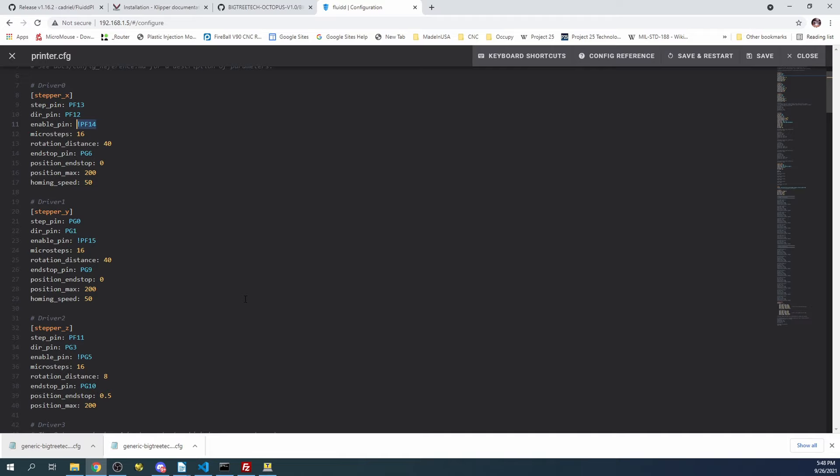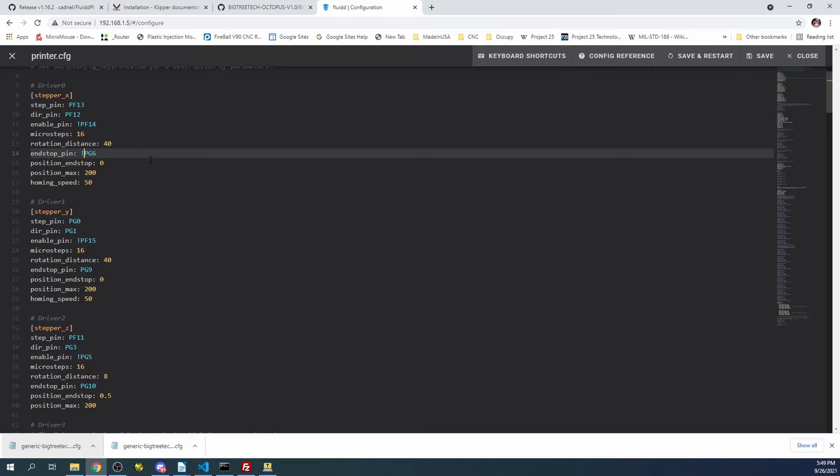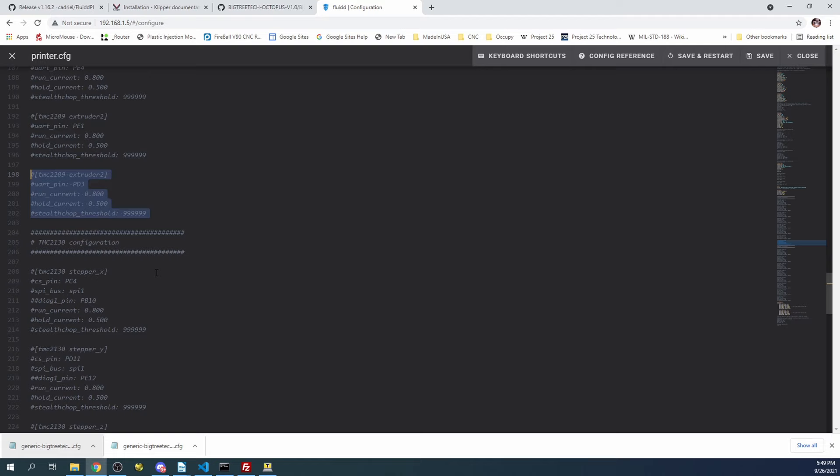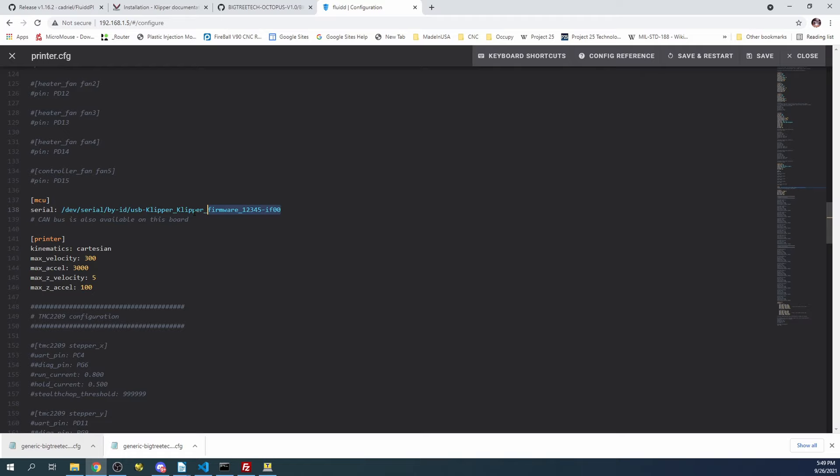In the case of our actual end stops, they're integrated into the X axis for the drivers. I'm going to be hooking up a special stepper, so I'm going to put an exclamation point in for that, which means negate - if it's true it becomes false, if it's false it becomes true. There are other settings down in here, but I'm not going to go too much into this because it's a setup video. The other important thing is going to be the serial port configuration, which I'll show you how to set up right now for the firmware.